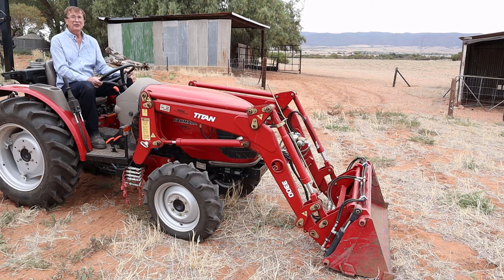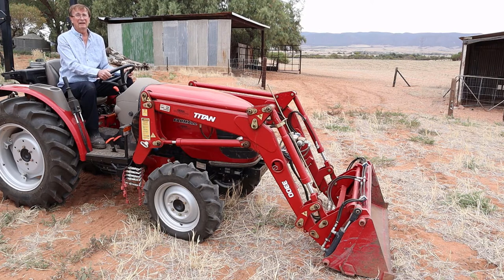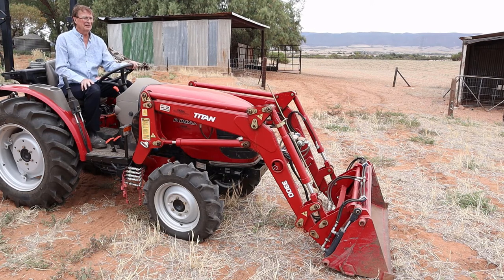The manufacturers recommend that you only run the tractor at 1500 revs or higher, otherwise the hydraulics won't work properly and the automatic system also needs some pressure before you can operate it. I'm going to turn on the tractor now and demonstrate all those movements.